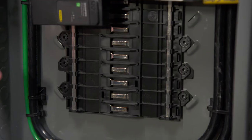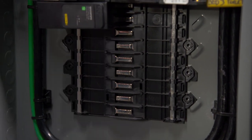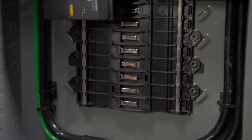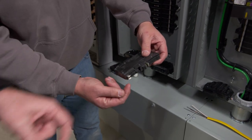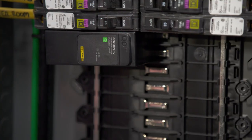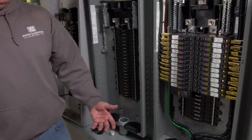The other advantage is this panel has a neutral bar that carries the whole way down, picked up by the breaker. We don't actually have to bring that pigtail to the neutral bar itself — you've got a neutral here and a hot/neutral on this side. This breaker has both built in now, so one connector is hot, that one is the neutral replacing the pigtail, and instead of tying it in, you just simply click this into place. So now you're not making up 20 or 30 pigtails.